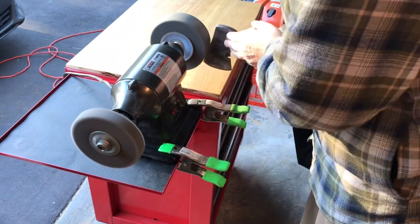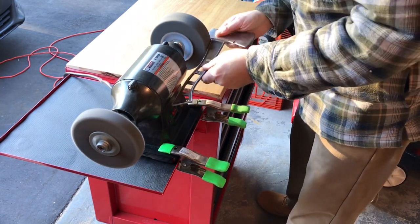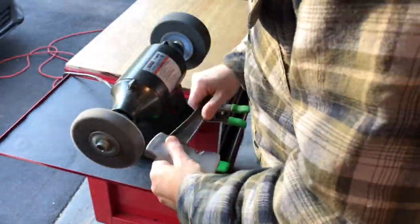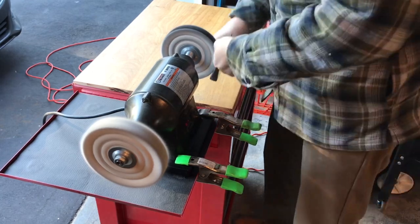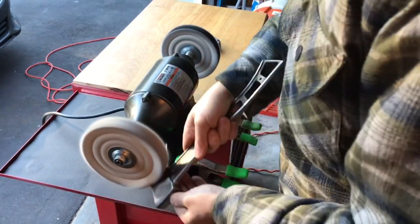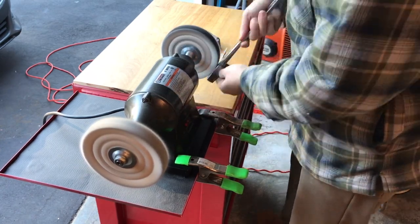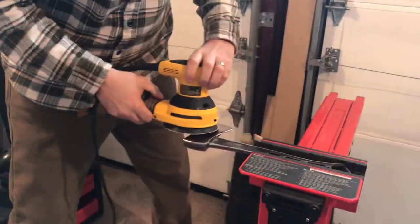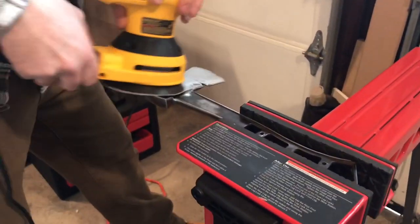Next, over to the fiber wheel — this really helps blend in a lot of those marks left by the flap disc. The coarser wheel takes off a little more metal and leaves a rough polish, then the finer one takes out those scratches. Then over to the polishing wheel to take out the final abrasions. I worked it for a while but wasn't fully thrilled, so I moved to the random orbital sander. I think I started with about 300 grit and worked my way up to 800.